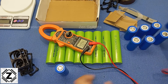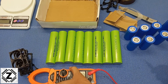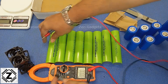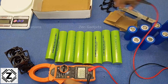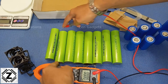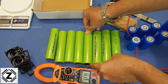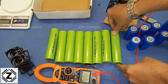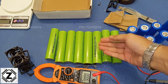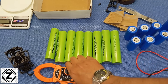I'm going to check each and every cell for you. Now let's check the larger ones — 3.278, 3.283, 3.28, 3.279, 3.282, 3.282. The consistency between voltages also shows how well-matched the cells are with respect to capacity, internal resistance, and balancing. The closer and tighter the voltages, the better.